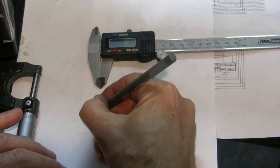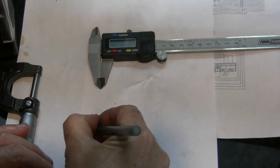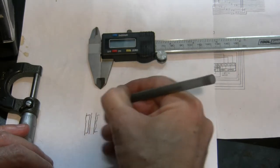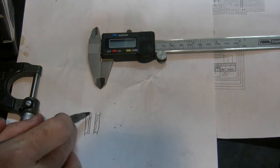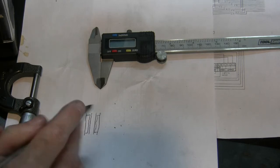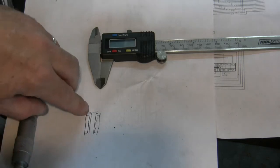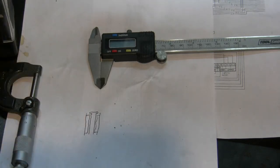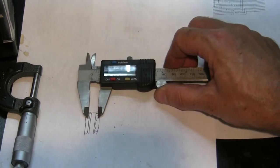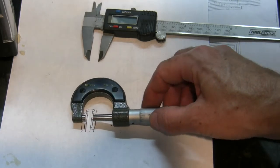Here's a drawing of a brake rotor. You've got that rotor spinning in between the pads — pad material here, backing plate to the pads, rotor spinning inside. You'll see that the pad rides not all the way to the absolute edge of the rotor. So what happens as you use the brakes over time — and I'm going to exaggerate this — it wears inward and gets a little bit of a lip on it. If you're measuring with a caliper, all you're measuring is that outside lip and you'll have a tremendous gap inside. So you need a tool that gets past that lip and into the actual area where the pads ride.